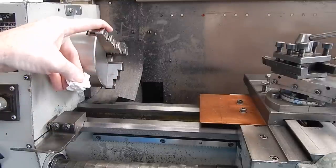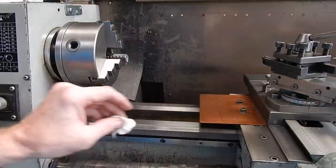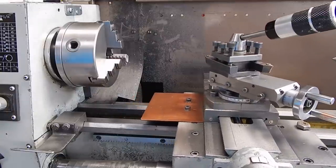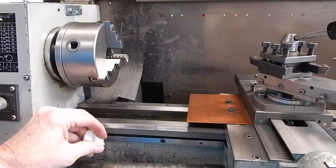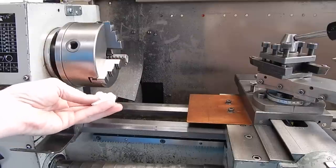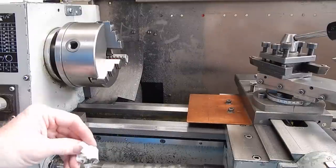I always have a purely oily rag to wipe over the lathe and keep chucks and stuff from going rusty, but on the ways I just oil it with automotive engine oil - light oil. Using a light oil will flush away any rubbish which may get under the carriage. If it can do the job on a car engine, it's going to do the job on a lathe. On a small lathe like this you don't want heavy way oil in my opinion - that's okay for a big lathe, but for a small lathe go for light oil. Anyway, the main use here is toilet paper - wiping it down, picking up all the grit and crap. You just toss it in the bin and you're good to go. Most important use in my opinion: use number two.